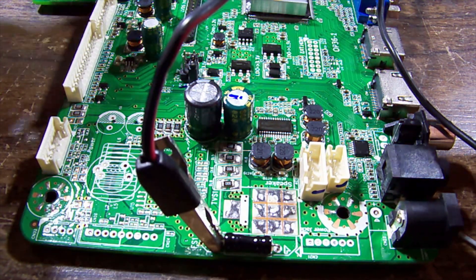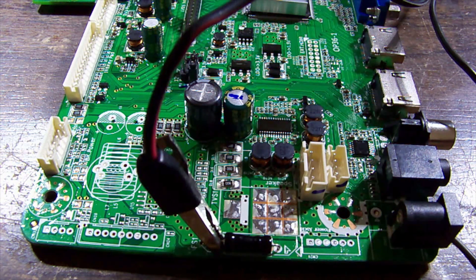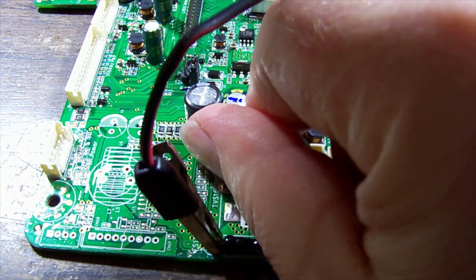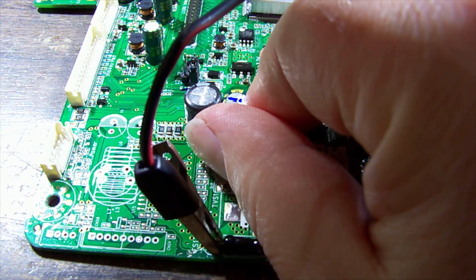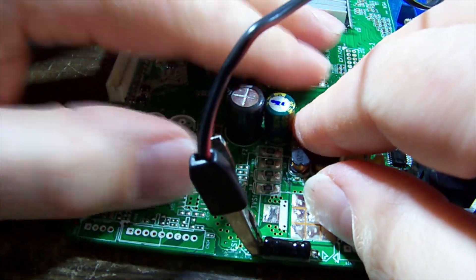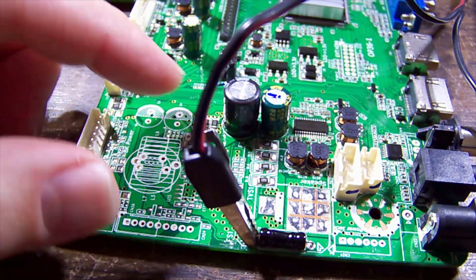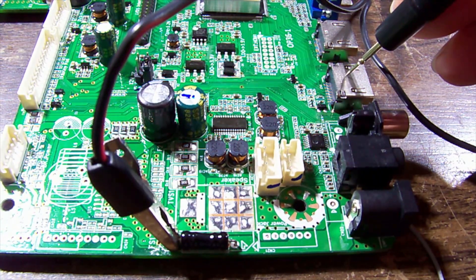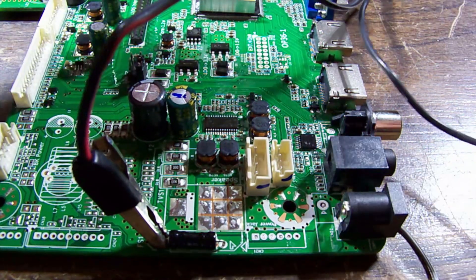Unless this needs 12 volts in to regulate properly, I'm just going to connect it. It's sitting at 20 milliamps and I'll slowly increase current. We're at 12 volts at 200 milliamps - nothing's getting hot. I think we're fine. I think that was just input capacitance charging that caused concern earlier. While I've got it on, let me quickly check if any regulators are operating.